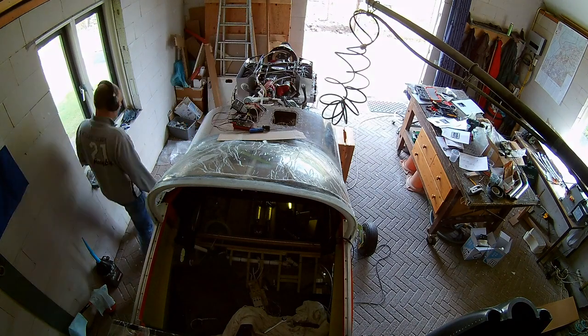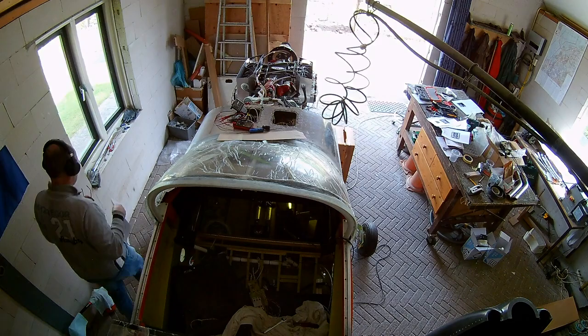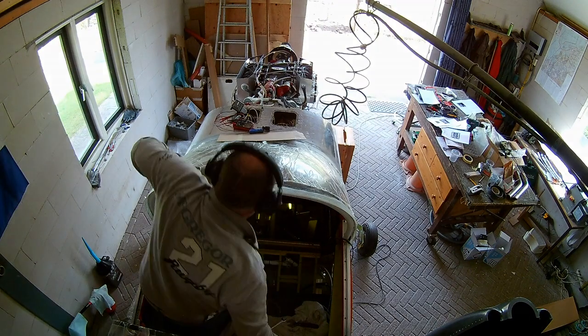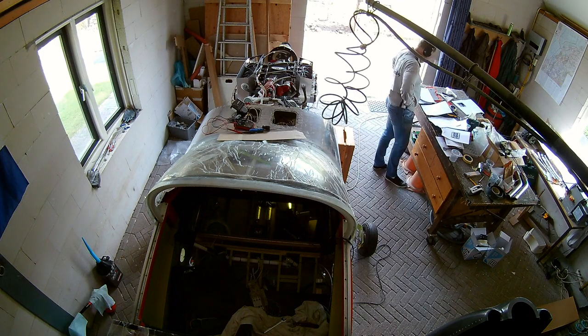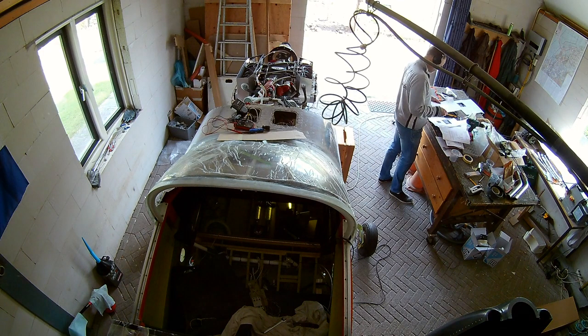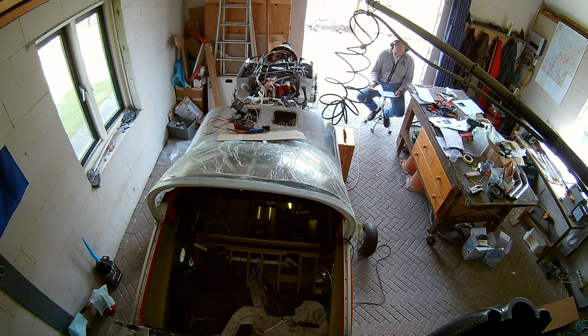However, I had to remove the ULPower air duct and open it to see what was wrong with it. Finally, I found a mistake in the wiring and I corrected that. And then the CAN bus measurements were matching up with the RS-232 measurements. Okay, continuing building my pie in the sky.